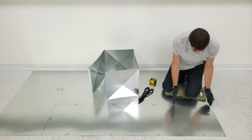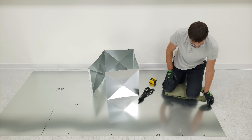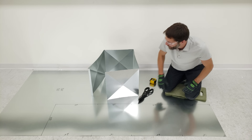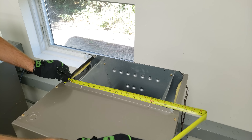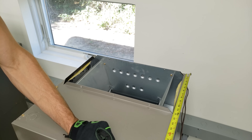If I'm making a 16 by 20, I need to have one inch wrap on one side, so I'm going to go one inch, 16 inch, 20 inch, 16 and 20. Looking at this air handler right over here, we're going to require a 20 inch wide plenum, and we can have a 12 inch deep plenum or a little bit deeper — we're going to go with 16 inch.